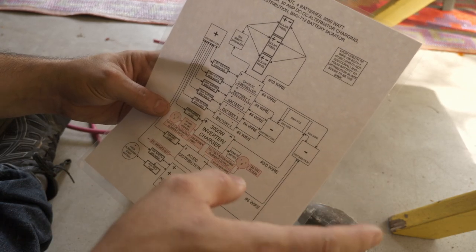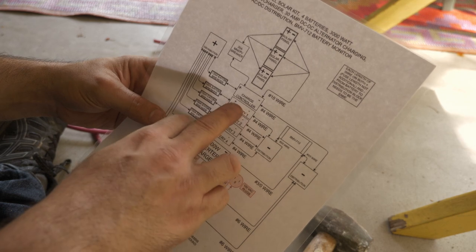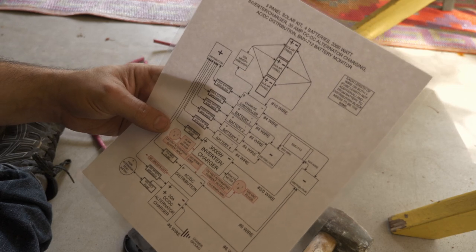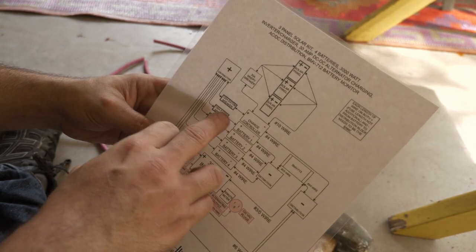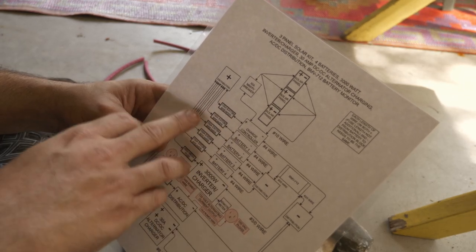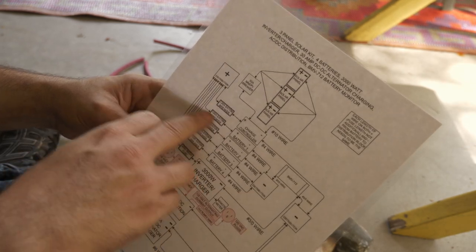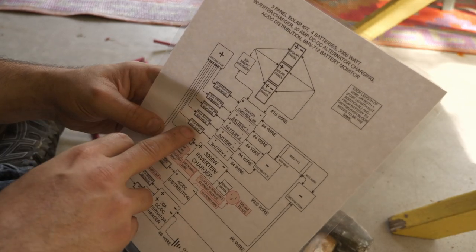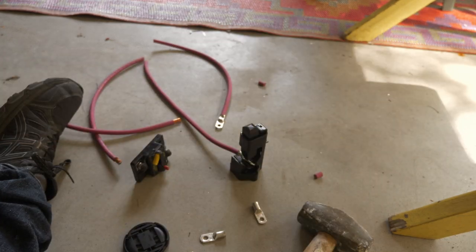After that, you want to keep all your wire lengths as short as possible, but the lengths of each segment are less important. Coming off the batteries to the distribution block on the negative side, all of mine are gonna be 16 inches. That's based on the size of the space in my ambulance to install them. On the positive side, they're gonna be a little bit longer, just because I have to go a little bit further to get to my distribution block, probably about 20 inches. So that's gonna be a 16 inch section here, followed by a shorter 4 inch section to get to the distribution block. So there we go, that's what we're doing today. We're doing this first 16 inch section to the breaker. Let's get started and show you how it's done.